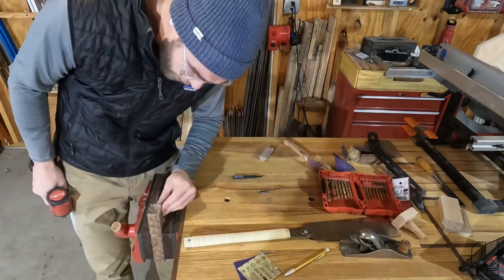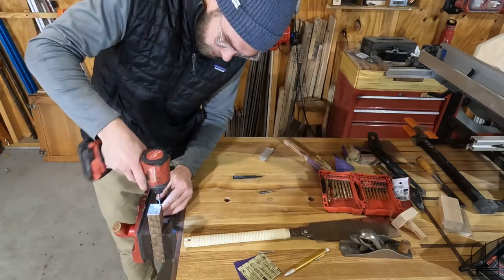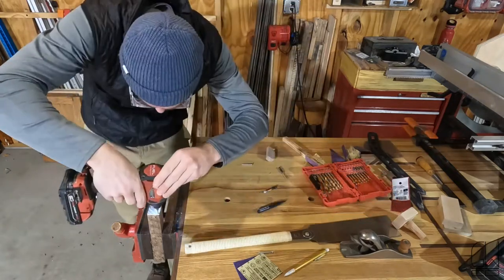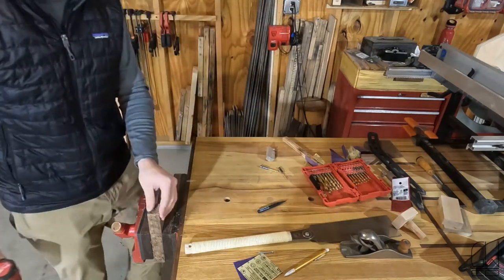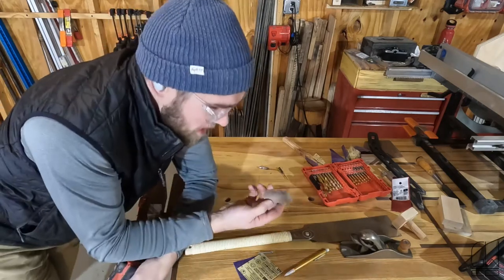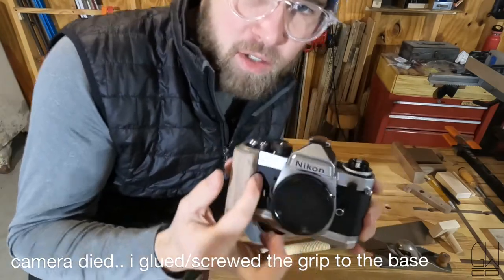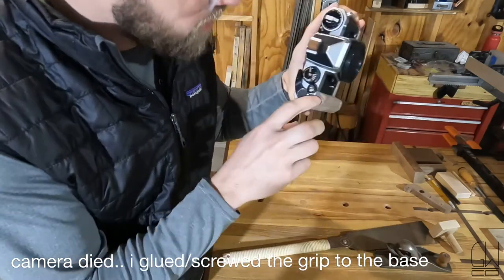I'm feeling the wood bulge a little bit. That's telling me that that's too tight in a thin piece of wood, so we'll increase the drill size. Yeah, that's the way to go. I'm really happy that I tested it, and I'm not gonna ruin this thing that I've spent hours making. I'm gonna trim this corner off so you can actually see the FE2. It's also gonna cut off the part of the top where there's some Gorilla Glue.